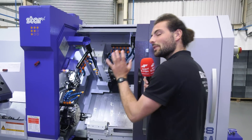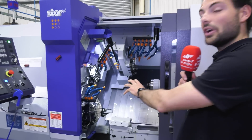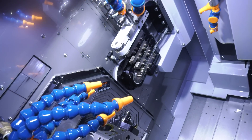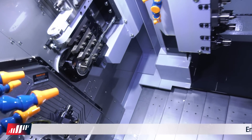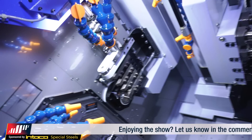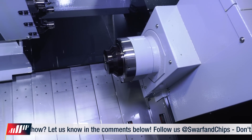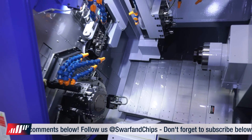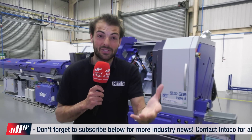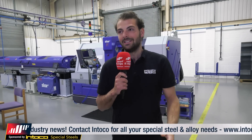We've also done a little interview with Julie who's on a lunch break right now. She was on the Star SX38 - one of Star's brand new machine tools. It's a little bit different because it's got a third head which is like a fixed head - you can rough on the fixed head and finish on the tool pots above it. It can do much bigger diameters, and you can also machine on the sub-spindle - drilling and turning on the sub-spindle, which you were never able to do before. Aztec has been investing in the SX38 to get into new markets, making connector back shells as well as connectors for the full kit in aerospace and defense.